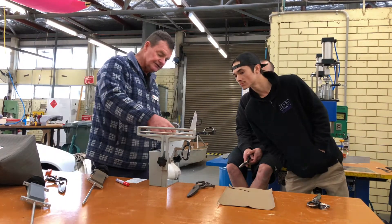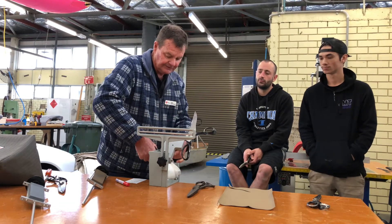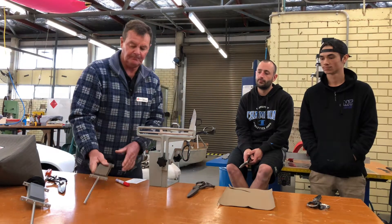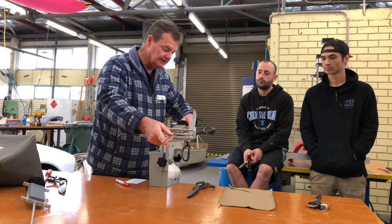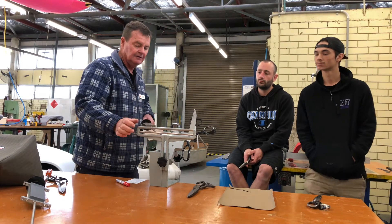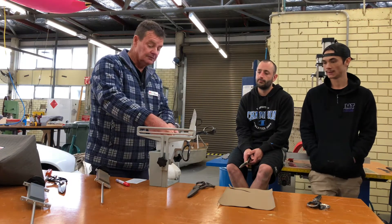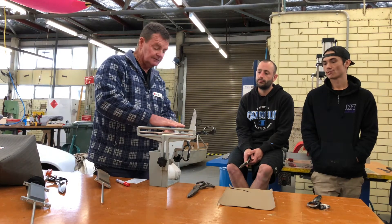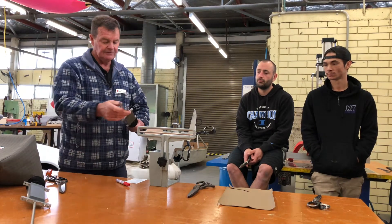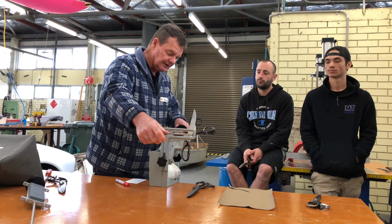You always pull through and out — you never try to sharpen back. After a few wipes I can see I'm taking the back edge and it's not cutting to the correct set, so I adjust it back up one notch. With the permanent marker ink on the blade, just one wipe is now taking metal on the set all the way through, removing that ink, so I know it's pretty well right. Using the flat smooth side of the stone again.